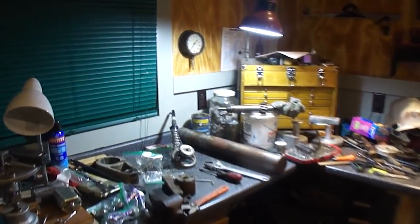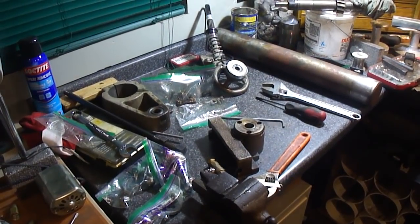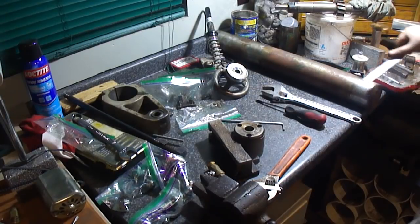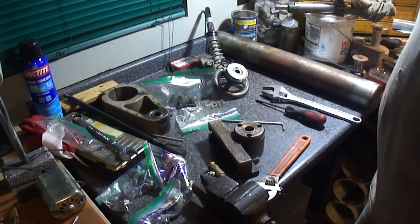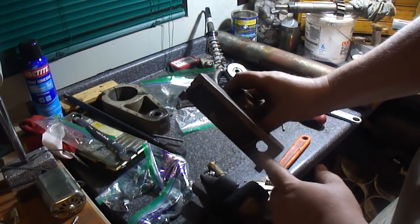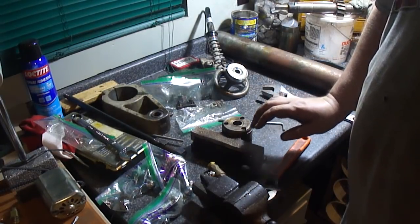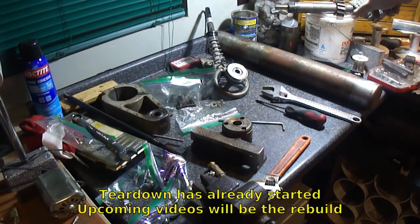Over here is all the parts for this thing. Here's all the overarm support, all the piece of 3-inch. Yeah, it's 3 inches across. And I'm not even sure how long it is. It's extremely heavy though, it's solid. The mill has fittings for 1/2-inch pipe threads on both ends for flood coolant. I've got drawbar, I've got all this stuff. I got stuff put away in baggies so I can find it. I think that's a 1-inch arbor up here.